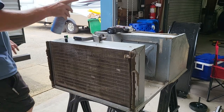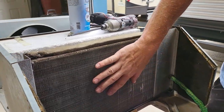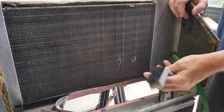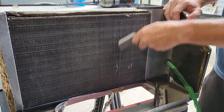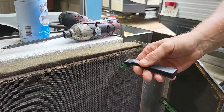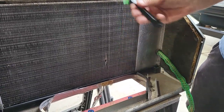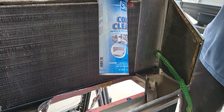You're going to do the exact same thing for the evaporator coil. If you have pets, you'll get a lot of hair accumulation and a matted look on here — this one's actually pretty clean. There's a device called a freeze control that you'll find stuck between the fins; it's supposed to be there, so remove it for cleaning and put it back when finished. Same process: brush it, comb as necessary — there's a little spot right here to clean up. Do not comb where the freeze control goes, but straighten out any other smashed or badly spaced areas, then spray with the rinseless coil cleaner.